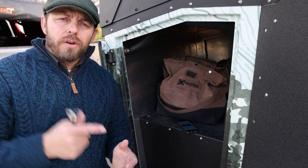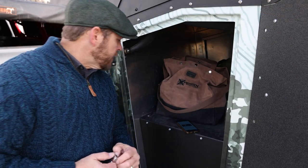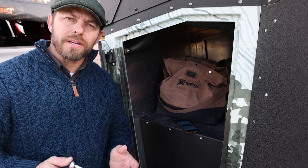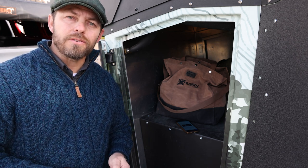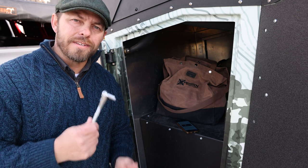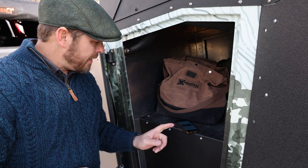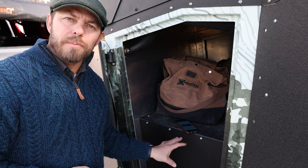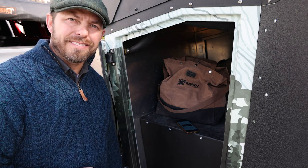While the water tank is draining, we can move on to step four, which is putting the Truma combi into bypass mode. In order to do this, you're gonna need a 5/16 wrench, and we're gonna take off this cover plate right here. And the Truma combi is located right behind this.